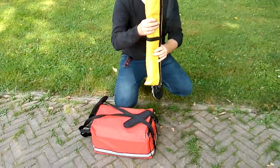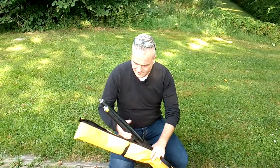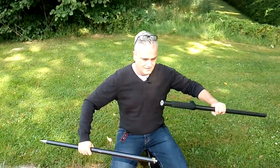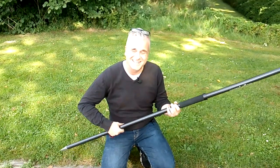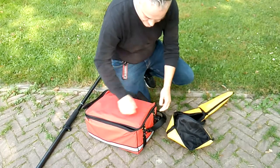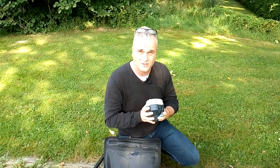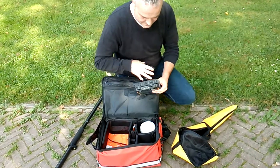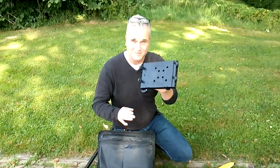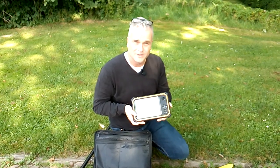What do you need for a topographic GPS survey? I've brought our kit with us — the carbon GPS rod. You can attach it together. Within the GPS kit itself, we find the GNSS receiver, the Emlid Reach RS2, already connected, a tablet holder, a rugged tablet — in our case the APGLOS Armor — and on this tablet we have the land surveying software, the APGLOS Survey Wizard.